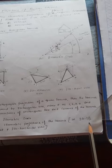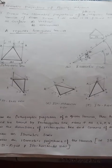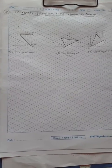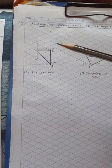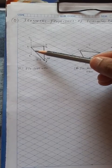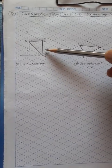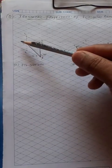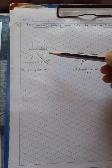Third step — drawing isometric projections of the lamina: iso left, iso right, and iso horizontal view. If you don't have an isometric sheet, use a plain sheet, or else use the isometric sheet — it is easy to construct. To draw iso left, we know that iso left uses the 90 degree and 150 degree lines. The 90 degree line is the corner vertical point, then the 150 degree line. Draw along the 90 degree and 150 degree lines, then mark point 1.